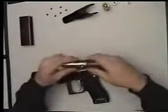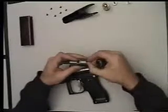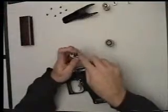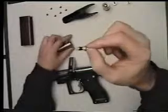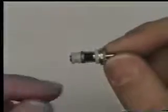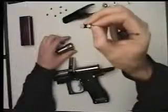Twisting the valve body apart, we have a couple of small parts in here which are the regulator valve. There are several small parts on this valve. If you find any of these broken, call AGD for replacements. There's several O-rings. It's not the type of thing you want to take apart. You should just clean it and oil it and reassemble it.